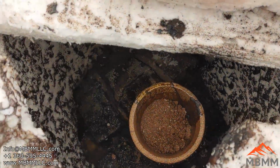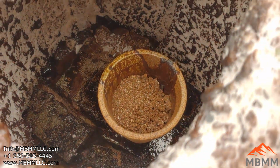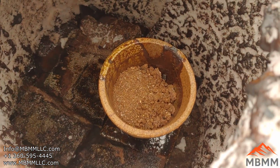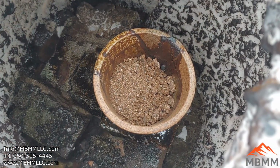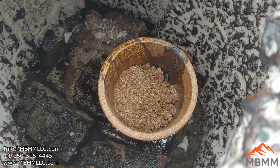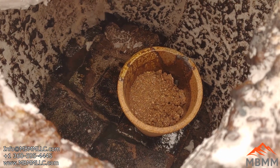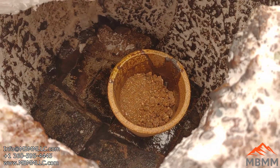All right, we've got our stuff loaded in that crucible, and I've been debating with myself about whether I'm going to use any flux or not. So the first one here with the number 1, I'm going to try with no flux and see if I can get it to melt down. There may be a bunch of junk on top we have to scrape off, but if it doesn't work, I can always add some borax to the top of this to get some of those oxides, some of that junk off the top. So we'll get her fired up here and see what happens.